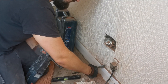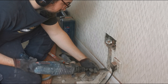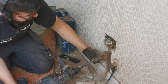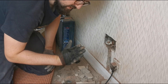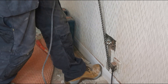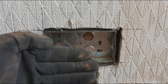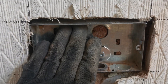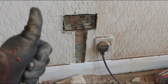Now all I have to do is chase from here down to the skirting boards. I give it a little chamfer towards the top, which allows the cables to go in easier — they'll just run up and curve off into the grommet holes. That socket is nice and flat to the back wall, perfectly straight. When you fix the socket screws into the lugs, it goes in nicely — if it were angled, the screws would bind and squeak. That's one socket done.